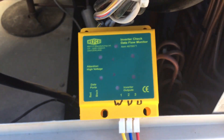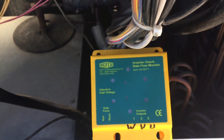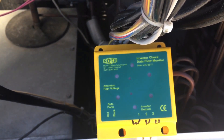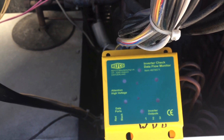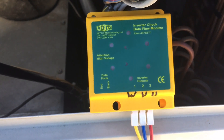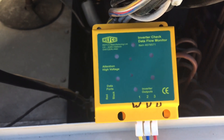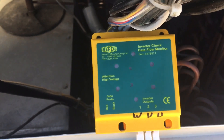I always mark all my lines on test equipment and my ends to match the same — these came unmarked. It is always nice when you are dealing with electrical stuff to know exactly where everything is going. You might get a phone call and get disturbed, or one of your apprentices might ask you to come over, and you delay, turn around, and hook back to the wrong connector.